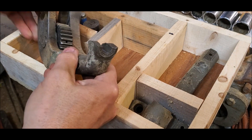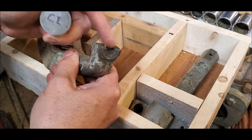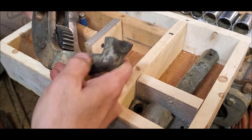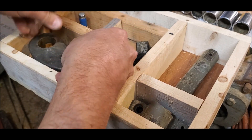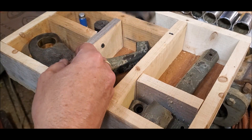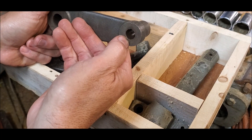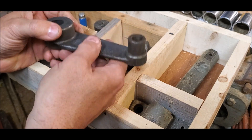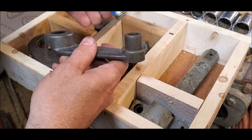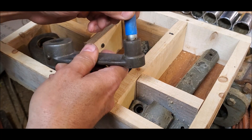Steve is going to be taking a piece of cast iron and making a boss that will be brazed and mounted here. Basically what he has to duplicate is the geometry in this lever. I've got a print that I'm including, but we've got a pilot and then I believe this is a nine-sixteenths fine thread that threads in that far and then stops.